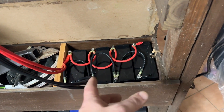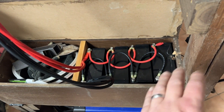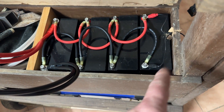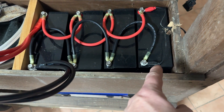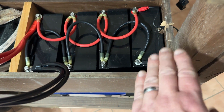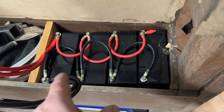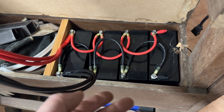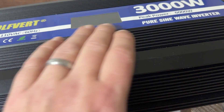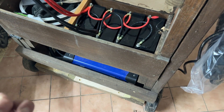What I think is happening is what I kind of assumed. These batteries, although wonderful, cannot supply enough current — the BMS is limiting it. When batteries are wired in parallel you can add up the current. The max for each battery is 20 amps, so we have 20 + 20 + 20 + 20 = 80 amps we can draw. But 80 amps at 12 volts isn't enough power. To start that weld it probably spikes over 2,000 watts — we actually need 160 amps from these batteries. So it's probably getting an under-voltage, and the welder is trying to start an arc and then stopping.